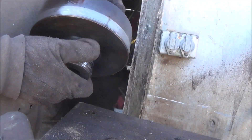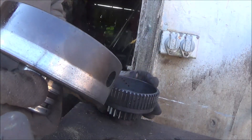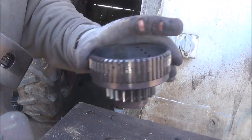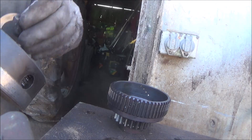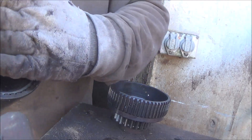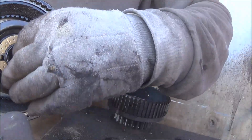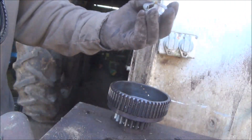Flip this over - should have a rag. Front half of the piece. Thrust washer - very important. Make sure it sets in there like that when assembling. If not, you bend those little tabs and mess it up, and then you're in a world of hurt.